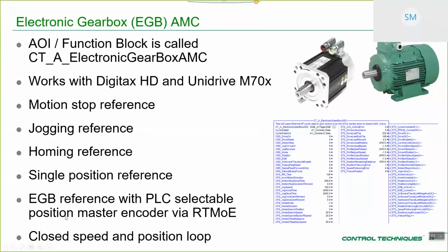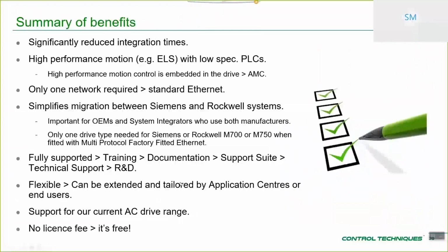selectable position master encoder over RTMOE. So essentially, for those of you that are familiar with RTMOE, you have a link number with RTMOE. What you're setting at the PLC interface is which of those RTMOE link numbers you're choosing to subscribe to from the slave or follower. And again, closed speed and position loop. So this is essentially the end of the presentation section.